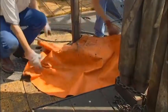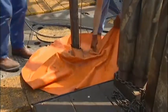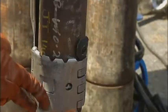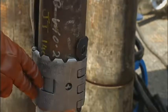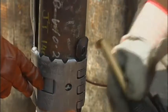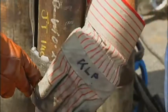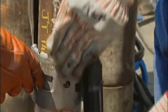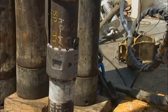The removal of a protector is simple and quick. A C-clamp is not required to remove the protector from the tubing. While holding the protector in place, the operator inserts the pin driver into the taper pin and drives the pin up and out of the taper pin loops. The top and bottom taper pins may be removed in either order.